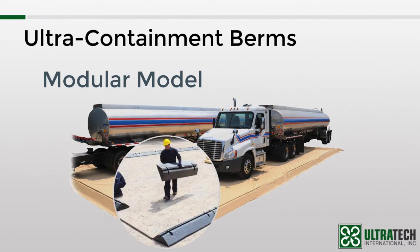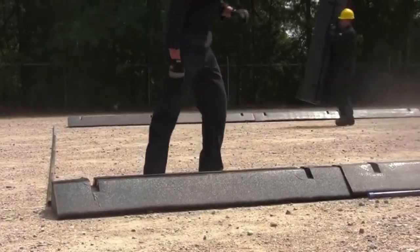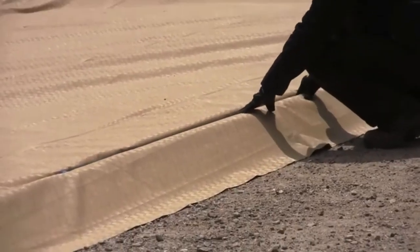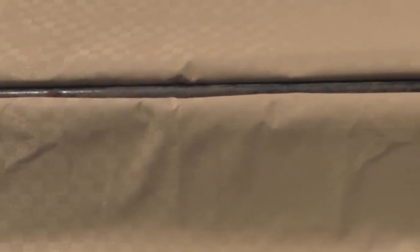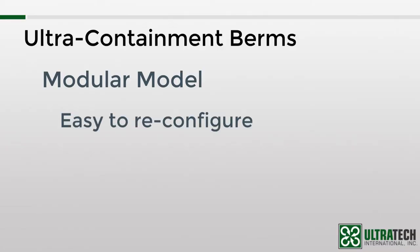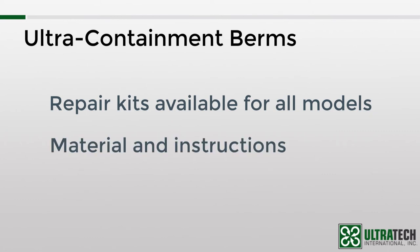These blocks are six feet in length and along with the corner sections provide the structure for the berm. The foam is coated with a polymer for added durability as well as chemical resistance. Once the blocks are laid out in the desired configuration, the entire area is covered with PVC fabric. To keep the fabric secure and in place, rebar or steel rod is placed on top of the fabric and then into a built-in channel in the top of each foam block. One big advantage of this model is that it can be reconfigured as needs change — for example, if you needed a smaller containment area, you can very easily just remove a few of the blocks, bring the remaining sections together, and replace the PVC fabric. Done. And while all of the Ultracontainment Berms can be repaired in the field, this model is the easiest. We do have a repair kit available for all of our berms, which includes a large piece of the appropriate material and instructions. Typical repairs are fairly quick and easy and only require a heat gun.